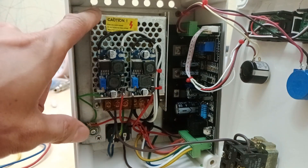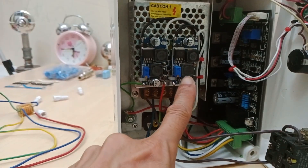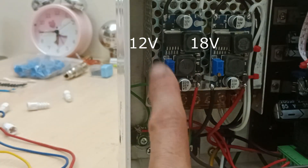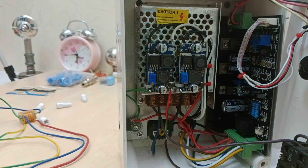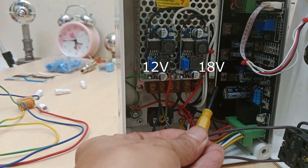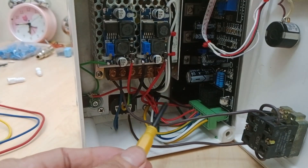This is a 24V switching mode power supply I got for free from the recycle bin. I got these cheap DC to DC converters — there are two of them. The input of the two DC to DC converter modules are simply wired in parallel and connected to the output of the 24V power supply. One of the DC to DC converter modules is set to 18V, and that supplies power to the powder coating gun mainboard.